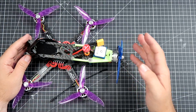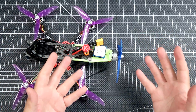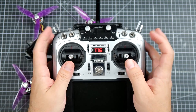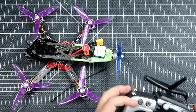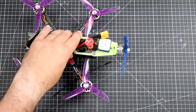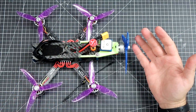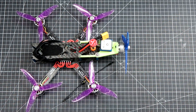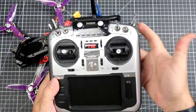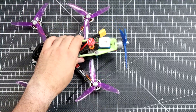The pusher motor itself is not automated in how it operates, because you only have two sticks. Because of how a quadcopter really flies, you do not have a stick you can assign this motor to — it's not working like that. Regular quadcopters do not have an easily assignable stick to just engage the pusher. This is why I'm engaging it on a switch — I have the channel and ESC assigned to a switch, so at 75% it's on, at 100% it's full throttle. Absolutely nothing fancy.